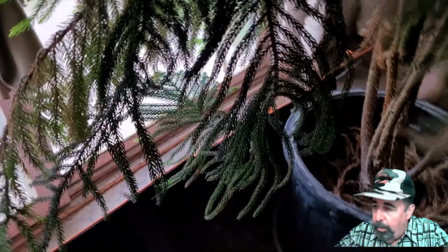Yeah, so here's that Flash Fish folding 18 volt 100 watt portable solar panel. I have it in the back room, our conservatory, where we have some plants for oxygen. And I thought I could just charge my Galaxy S20 using this. And the Galaxy S20 actually discharged while connecting to it in this scenario. So you have to put these things in direct sunlight.